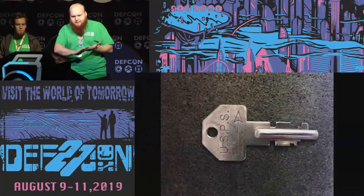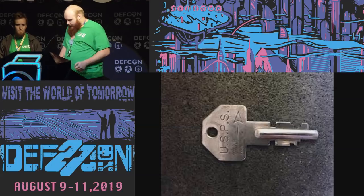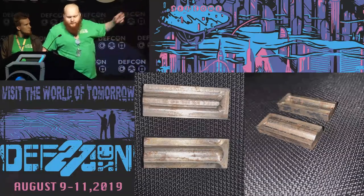There's something else interesting about these arrow keys though, and that's that if you look at it, it hasn't been milled out. It's different than most of the keys you'll have in your wallet. It's been pressed out of a flat piece of metal. So here's an example of the dies, excuse me.